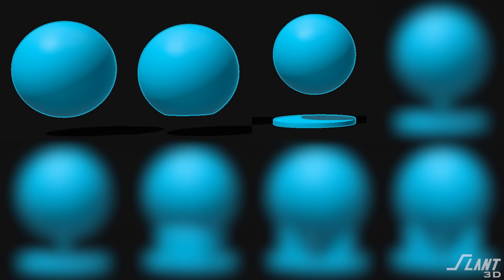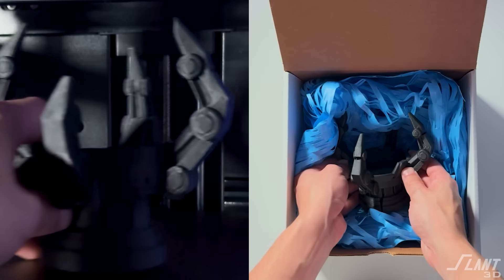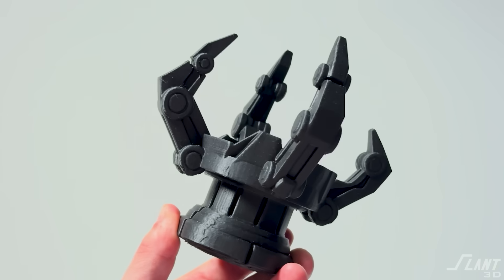It's important to emphasize why design matters here. You might want objects mass produced — for example, uploaded to a service like Portals where they can be printed and shipped straight to customers. To do that, you cannot rely on print settings. The best way to make a part that is manufacturable is to make a part that can be produced anywhere, anytime. You do that inside the CAD, designing parts that are reliable and robust so they can be uploaded to any system and produced reliably.